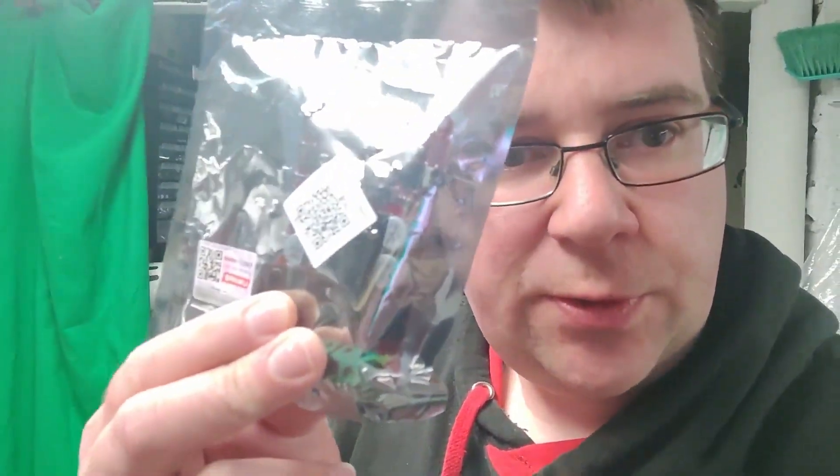I had a bit of a chat to Loz — this is Loz of Lozcon — and he was talking about that his droid has a particular amp in it which has Bluetooth, one like this. So that got me thinking: I could change R2's amp, which at the moment is a motorbike amp, and put this Bluetooth module in. That way I can have the best of both worlds — the curated, authentic R2 sounds everybody knows and loves, and also when a little kid comes up and wants to have a conversation with R2, I can make him respond with unique sounds and reactions — happy, sad, petrified, whatever. It will sound like he's really trying to talk to the kid. I've had this happen a few times and really wished I'd been able to do it.